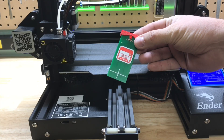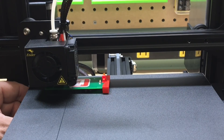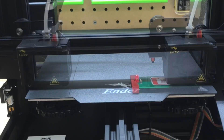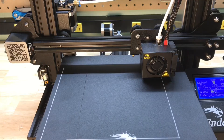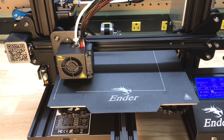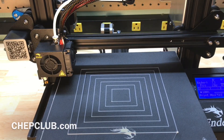For leveling the bed, I recommend my Filament Friday e-leveler tool. You download a G-code file, run it, and it will position the head at each corner. Adjust the knobs until the LED just lights and you'll have a near-perfect level bed. There's also a file you download that draws squares on your bed — when it's done you'll have a set of squares equally positioned around the bed, smooth, just like this. A perfectly level bed.